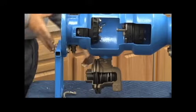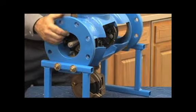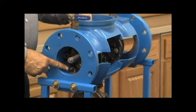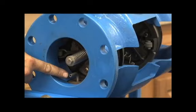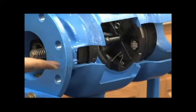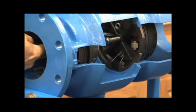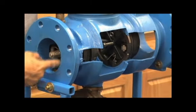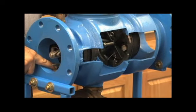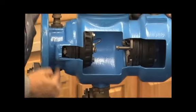Now I want to show you one thing before I reattach the relief valve sensing line. If you'll notice in the water passageway, there's this small little stainless steel tube. It's what's called a pitot tube. Because of the check design that we have through this particular valve, it is possible to develop a high velocity as the water travels past here. It hits that check and creates a little turbulence around here. That if we had trouble with turbulence or velocity across this point, this is our high pressure sensing line that goes to our relief valve right down here.